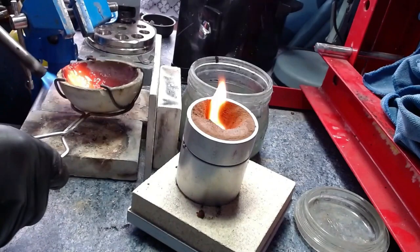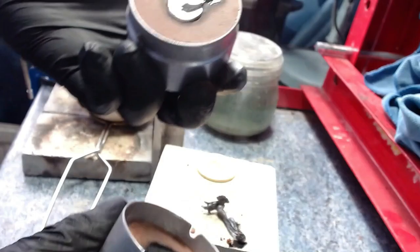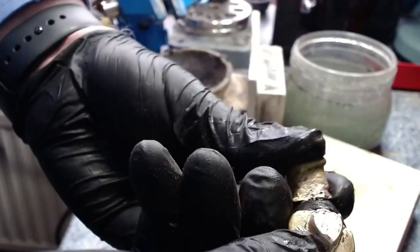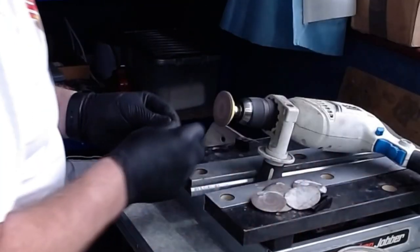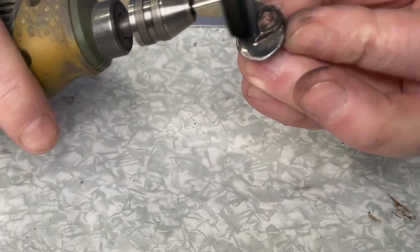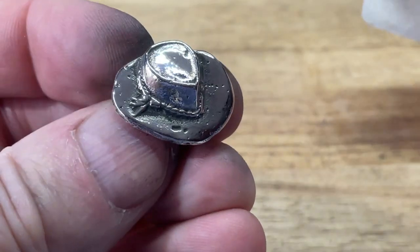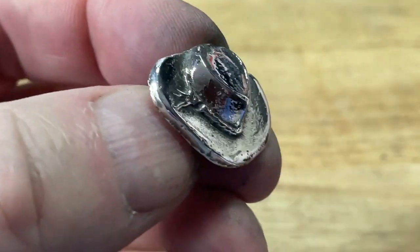There we go — that was a good pour. Open it up and you can now see: the casting sprue is not underneath the hat, it's just to one side, which you can snap off and file down. There is nothing on the back that means cutting off and filing. Therefore, the finishing detail is much simpler and quicker. The most time-consuming part was actually just preparing the casting mould. The finishing turned out really quick and nice.